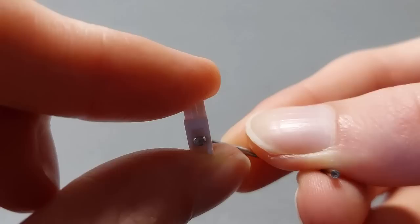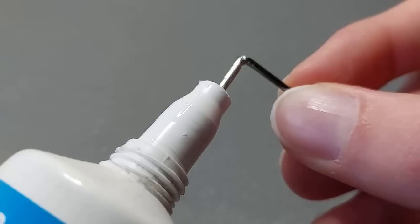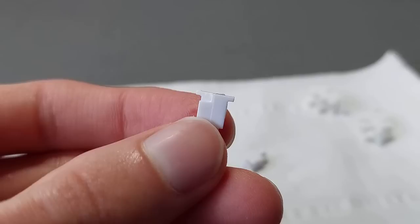when the tape was added to the stem, the wire didn't actually fit through. Instead, I decided to leave them as they were, and re-grease the wire with dielectric grease. When clipping the stabilizers, I removed the two extra legs, and used a knife to cut away the uneven bottom of the stem, leaving the contact surface flat.